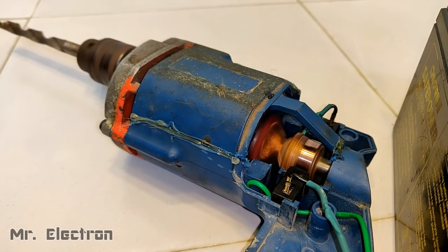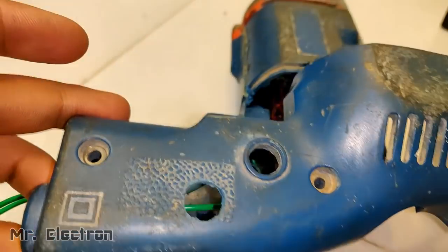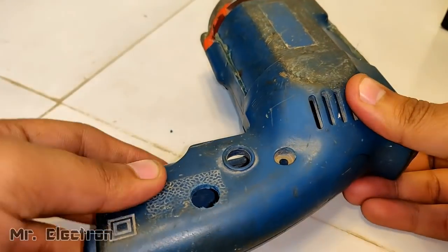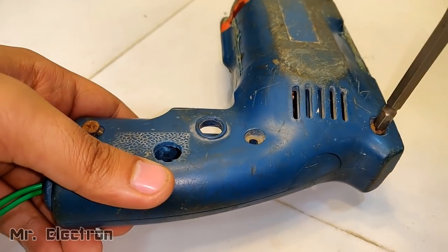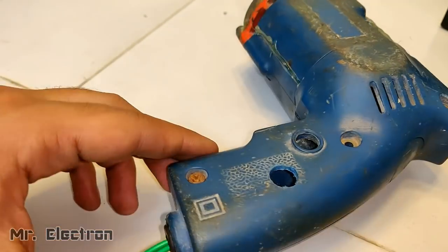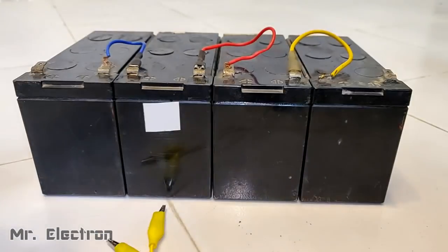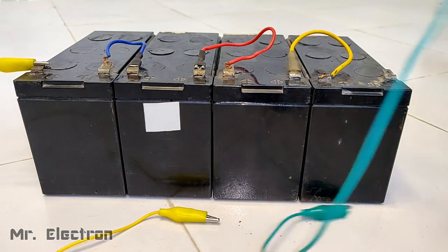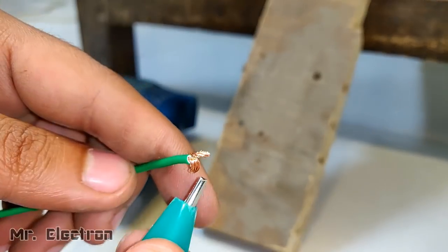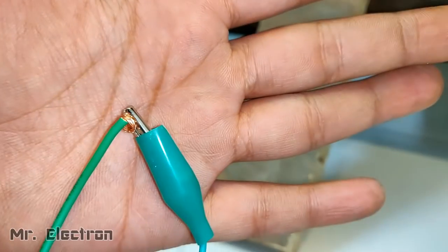So obviously, even though placing the magnets makes it a permanent magnet DC motor, the resistance value is still very high, because of which it cannot run at 12 volts with a battery. Anyone who says or shows in a video that the machine can run with a 12 volts battery is showing you a fake video. Okay, connecting the 48 volts pack, connected,